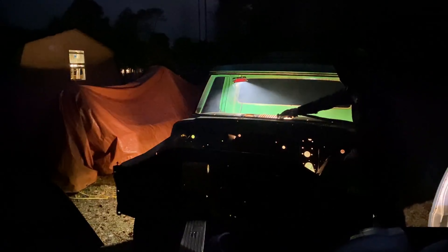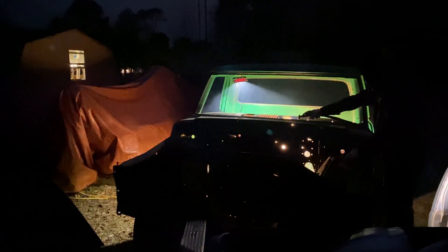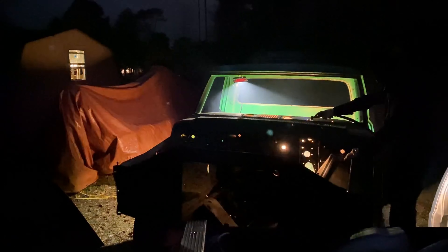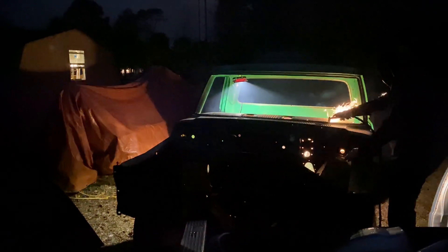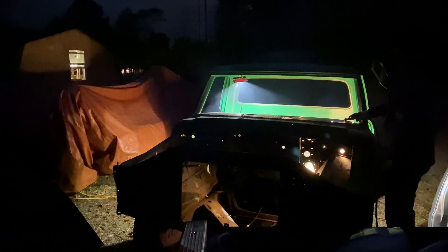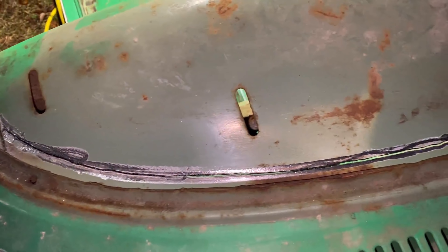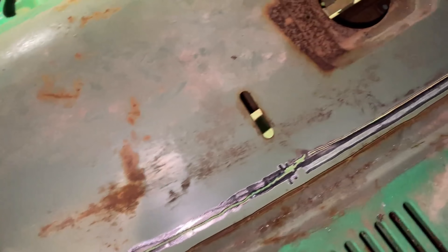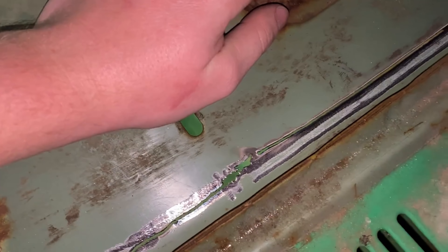There's a look at that first cut. I ended up sanding off the paint because I think that was giving me some sputtering action, and it cut right through it like a hot knife through butter. So I'm going to do that to the rest of it. You can see I just took the little belt sander to it and cleaned it up some, and I got a nice clean ground that I sanded too. I also dried it off — there was a little water sitting there — but it's going pretty well. I'm going to get some more light out here and keep going.